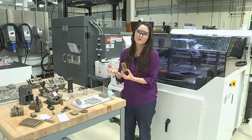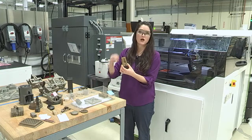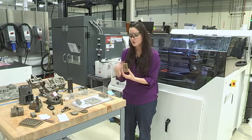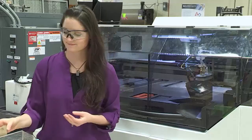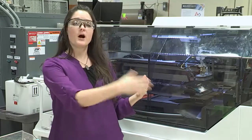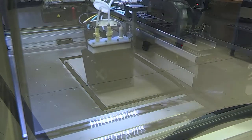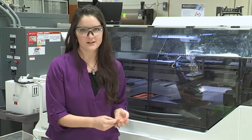This is actually really improving the casting industry. Not only does it give us more geometrical control over the part, but it's also making the sand pack much more uniformly. So there's not different areas of density — there's very uniform density within the sand cast mold. Really bringing some consistency to an otherwise inconsistent and tricky process. This is our binder jet machine — it's got a really big build volume, and actually the throughput on binder jet is really, really great. The actual time it takes to deposit the binder is not very much, so if you pack a lot of different parts within the printer itself, it doesn't really add to the build time. I can cure all the parts at the same time because they're on the same build pack, and then sinter and infiltrate them all at the same time. This process is really conducive for mass manufacturing.